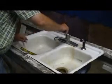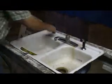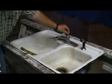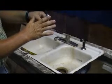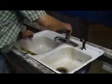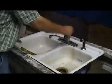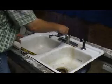I'm going to put my arm back on. Then I'm going to come under here. Now, let me tell you one more thing about the ball before I put this arm back on. It has a little slot right here on the front, flat spot. The rest of the little arm is round. And that's so that this screw can go in there and tighten up on it and hold it into place in that one spot. So I look here, I put my arm back on, get my little Allen wrench, and I tighten it back up. And I check to make sure that it feels right. It's moving in all the right directions and stuff.